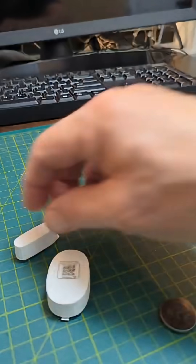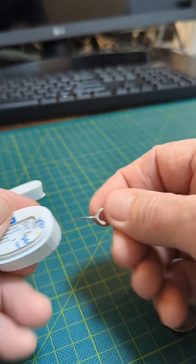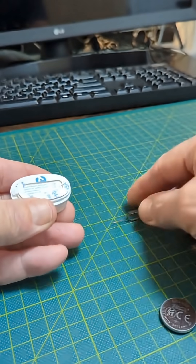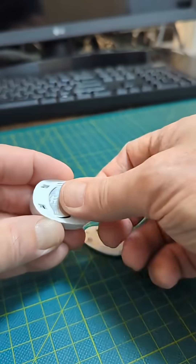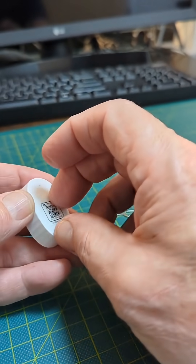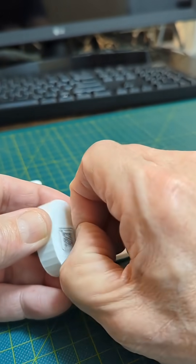The first thing I'm going to do is remove that label — that's the QR code — and put it on the inside. I'll set it up so that when somebody opens the gate, one of my notification lights in the house goes off and on. Let's put the battery in. You poke this in the side and use it as a lever to pull. There's a little pin here that's holding that in place. That comes off. Let's push in the battery. Before I put it back together I'm going to take this label off the front and put it on the inside, because I'm concerned it's going to get worn out and I won't have access to the number or QR code for pairing in the future.